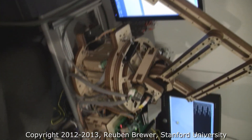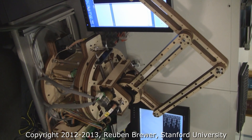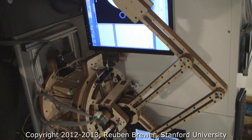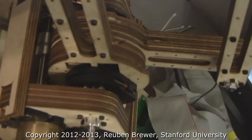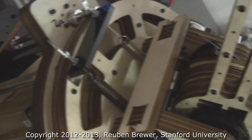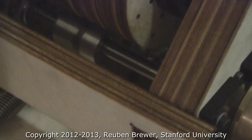To further reduce inertia, instead of using weight as counterbalance we use spiral pulleys. For this mechanism, what's great is that each of the joints' gravity torques depends only on its own joint angle — for example, for joint one it's just a function of theta one. That makes designing the pulleys really easy. These are the spiral capstans here, and they're connected to linear extension springs down here. Go ahead and move the knob — you can see the spring stretching. And they have three cable capstans. This is their first time using a lathe and they did a very nice job.